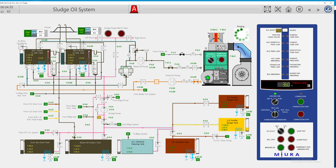Let's start our cooling fan. Depending on the incinerator, there are different kinds of design. Here we can select what we are going to burn — I prefer this kind of selector because it's much easier than a touchpad monitor which sometimes does not receive the order. Here you can directly select what kind of waste you're going to burn. When burning waste, do not overload your incinerator because it will damage it and cause a lot of cracks. Let's start with waste oil only.